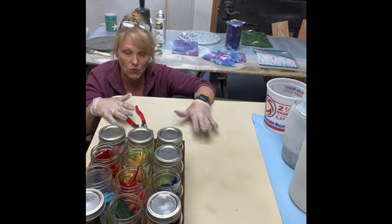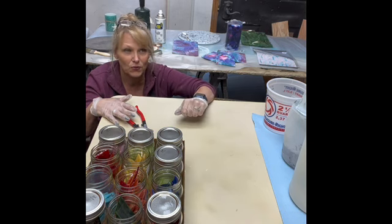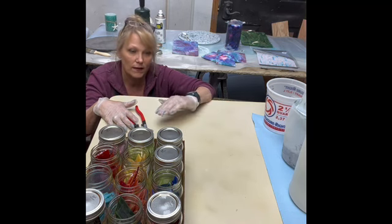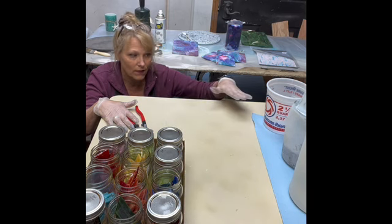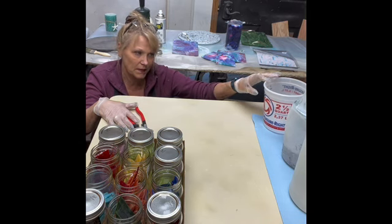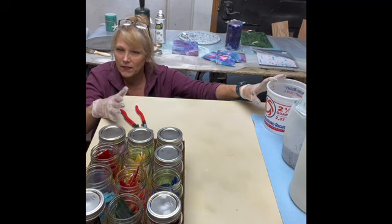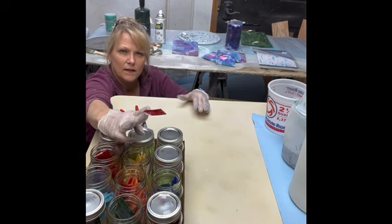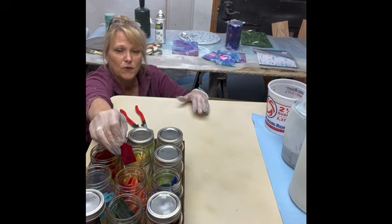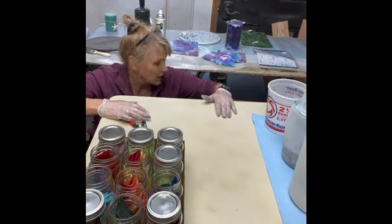On this one, I am going to dam the edges. The reason is this is glass, so we're not going to be able to sand the glass down to level. I want to put an edge on this with tape so that it's all going to be perfectly level when I'm done because we're using flat glass. I'll be using probably six ounces per square foot, up to eight ounces, really depending upon how deep I want it. The glass isn't very thick. It'll probably be about six ounces. I'm going to try six ounces and we'll see. Let's get started with the epoxy — we're doing the second part of my research.